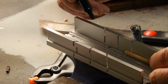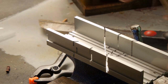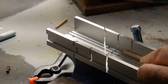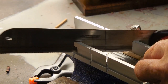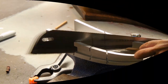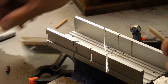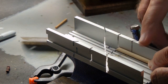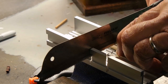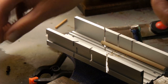Then I want to use the scrap from the 45, and it needs to be pretty tiny - so right about there, I've got that mark. So I want to first cut this first 45, putting that right on the black mark, and then very gently cut these. Here's going to be for the top - I'll save that. And now that I have the 45, I can put just the top edge of that diagonal cut right on the edge of that black line, and now straight across.